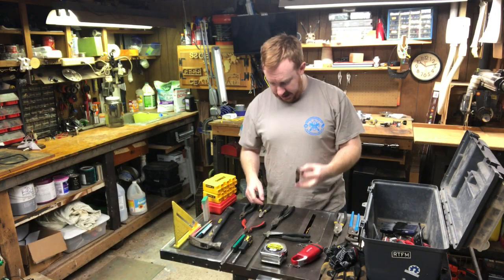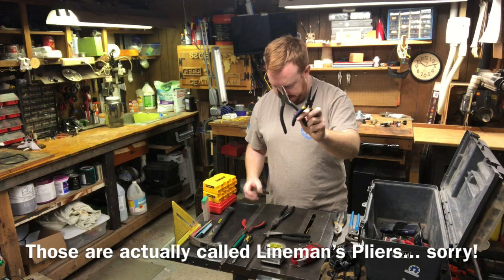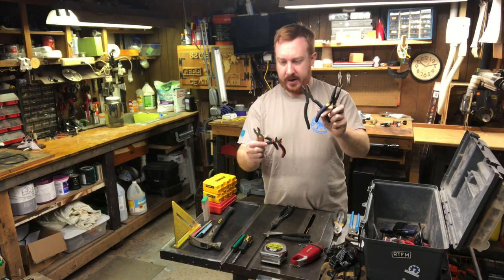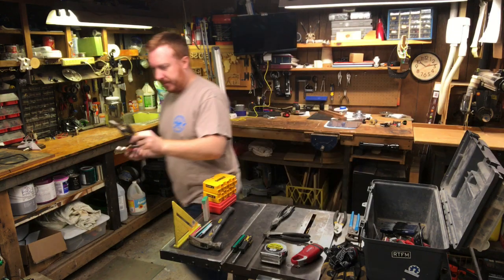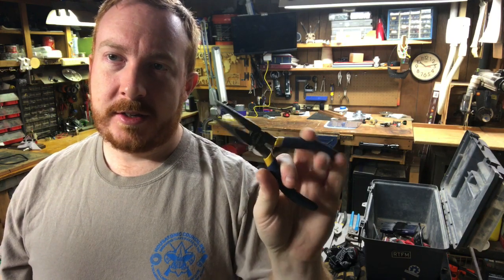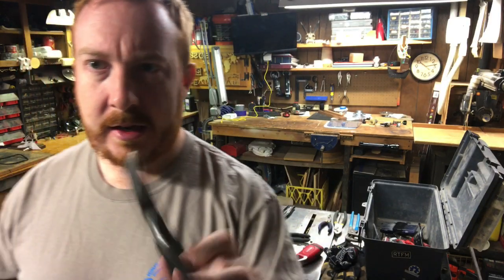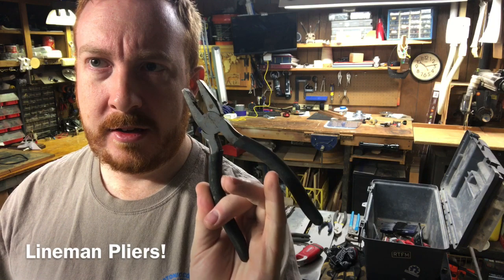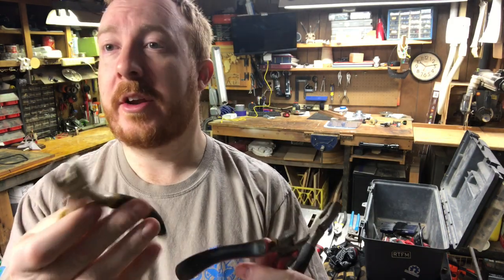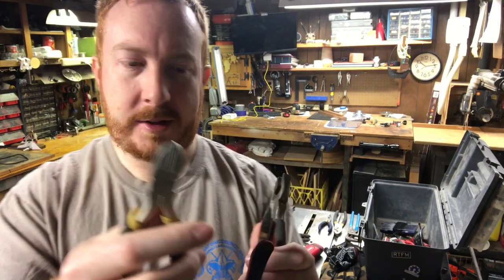In terms of smaller ones, you're going to need a pair of needle nose, a pair of like diagonal cutters, right? And then a pair, I have actually two pairs here, of actual cutters. I don't know if you can see the difference here. So this would be your needle nose, right? So if you're doing electrical, replacing a light switch or something like that, these come in real handy. These guys are slightly different, but they do have a cutting jaw at the bottom and grabbing at the top. And then these are just cutters. So if you're doing zip ties or something, you can cut these. You're cutting electrical wire. These are spring-loaded, which is kind of cool. Saves your hands a little bit. And these aren't, but that's okay.